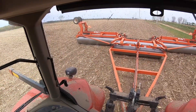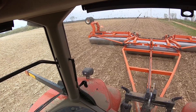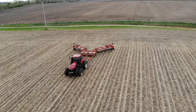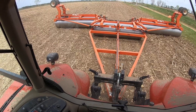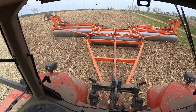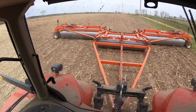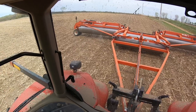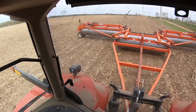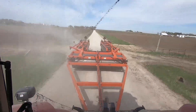I've got it on a wide screen so you can see how this works. Watch this — one of the hydraulic levers controls the wheels and you can swivel the wheels out on the wings. That's actually how you get it to swing out: you swivel them kind of like this and then you drive forward until it swings most of the way out. Then you swivel them straight and back up until those arm pins can get into these black latches on the front. When I pull that lever, it opens those latches — it also puts the wheels down on the wings. When they hit the ground it lifts the roller off the ground on the edges, drops the latches in the center, and starts picking up the middle roller. Once it's all the way up with the wheels turned sideways, you drive forward gently and it just starts pulling the whole thing straight down the road just like that.